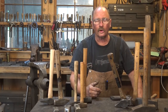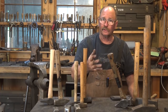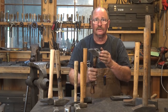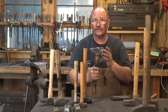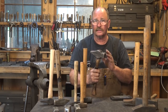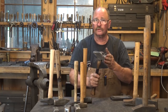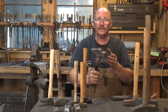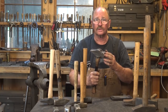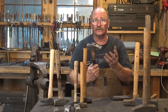All of these hammers share one characteristic — and so did the diagonal peen hammer we looked at yesterday — and that is they tend to have one flat face, sometimes a little bit curved or domed. Tighter or softer radiuses are all personal preference in how you dress your hammer. If you buy one new, they're usually pretty straight across and kind of sharp, so you'll probably need to dress them before use. When we talk about hammer styles, we're generally not talking about the primary face. Whether it's a cross peen, straight peen, diagonal peen, rounding hammer, or ball peen hammer, they all tend to have one face that you do most of your forging with, and then it's the peen that sets it apart. How you use that peen determines which hammer you might want to use.